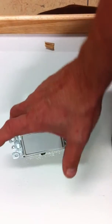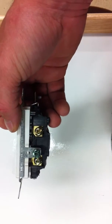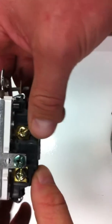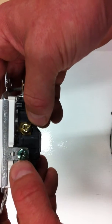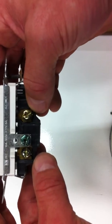This is a Decora light switch. It's a single pole switch. It has two screws in the back. I'm going to take this apart today and show you how it actually works. You have a live wire coming in here, and then the wire that goes out through your switch goes in here. And this on the yoke is the ground wire, which protects the box and makes everything grounded.